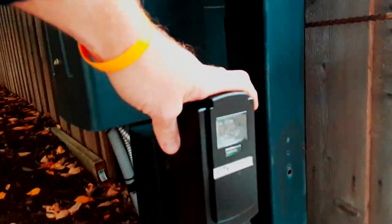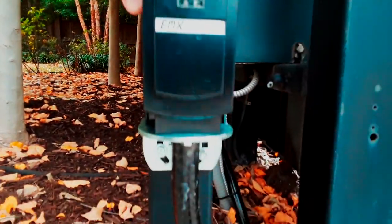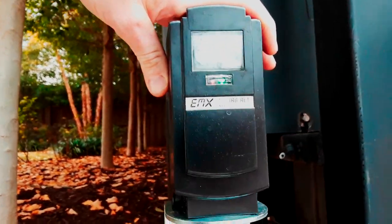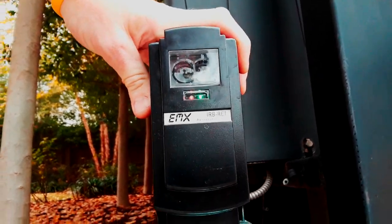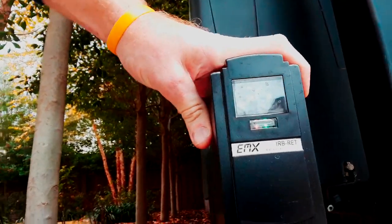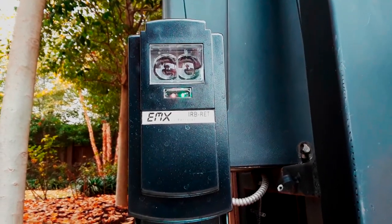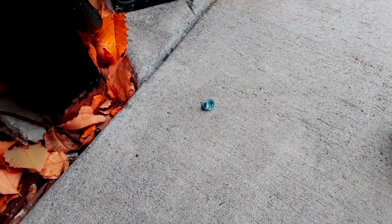The only thing we need to do is make sure the gate operates safely and that we installed it properly. I want to be able to push it up and down and left and right without the LEDs going off — that means it has a relatively good tolerance for wind or being bumped. The broken bolt down at the bottom would have had the most leverage against it, so having that broken is not a surprise.